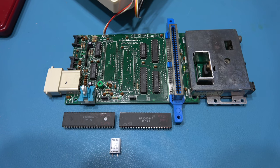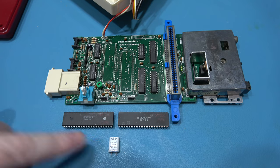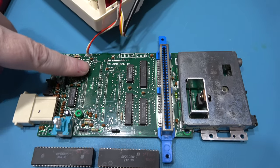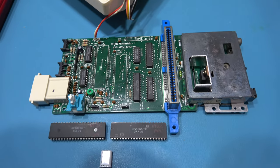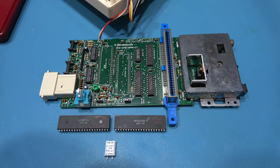That's the NTSC CPU, PPU and Crystal Oscillator removed from the Famicom board, and I'm happy to report that both the CPU and PPU came out perfectly fine, no lifted pads, so I can reverse it if I feel like it.